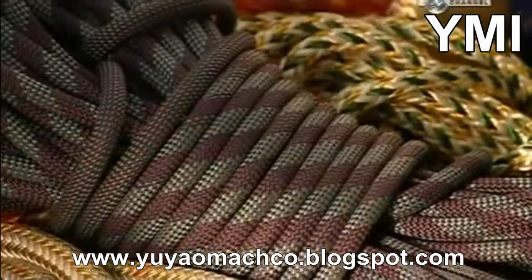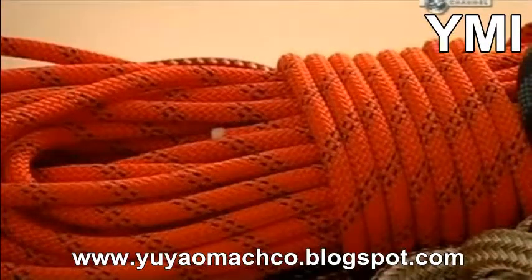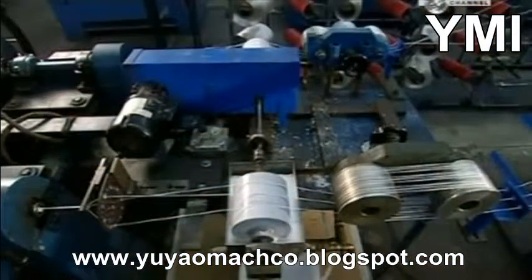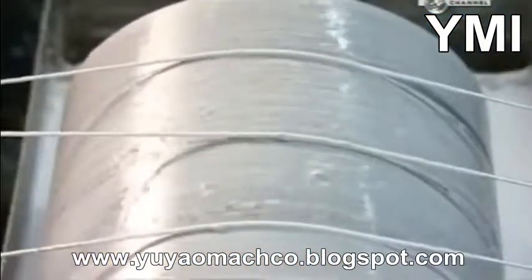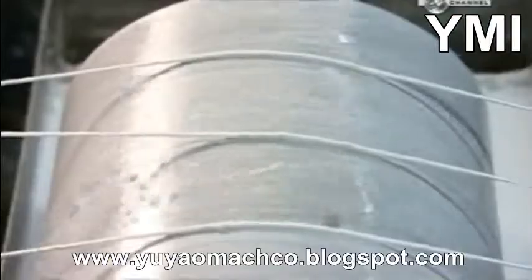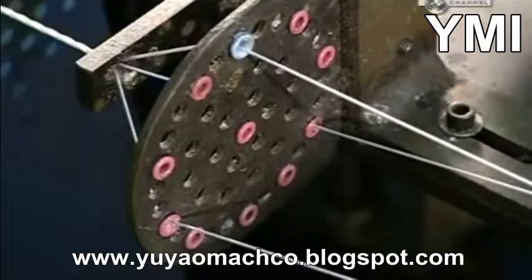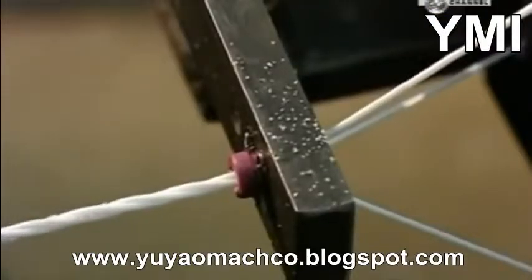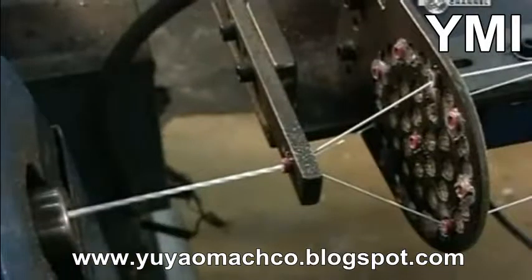These ropes are made from thousands of nylon fibers that are finer than human hair, but stronger. To make rope, yarns are wound around aluminium cylinders, pulled by a turning spool. Then, 3 at a time, the yarns roll over another spool that applies a protective coating of urethane. They funnel through a distribution plate that holds them evenly apart. This ensures they're at an even tension as a rocking spool twists them into one larger yarn.